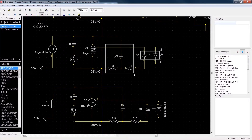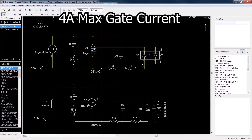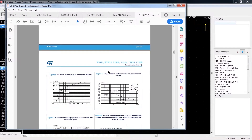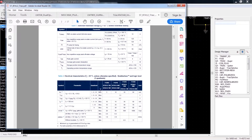This little circuit here had me scratching my head — I couldn't figure out exactly what its purpose is. The triac needs a resistor to reduce the current going into the gate; you can't just dump a bunch of current through the gate or you'll burn it up. This BTA-12 is a 12-amp current-handling capacity with a 600-volt VDRM. That's how much voltage it can handle when it turns off — basically a blocking voltage. We're using the standard gate current to turn it on, which is 50/25 milliamps. I wanted to show you the recommended implementation circuit.